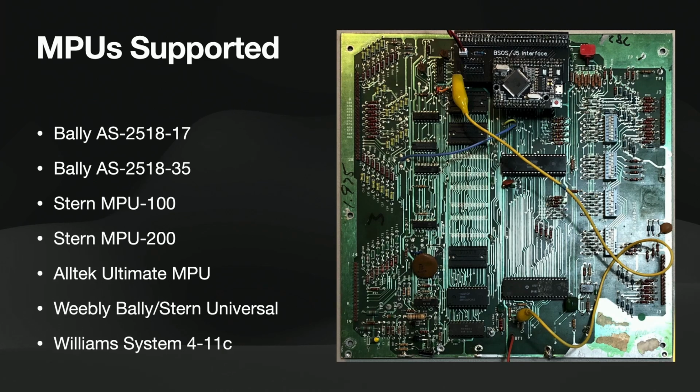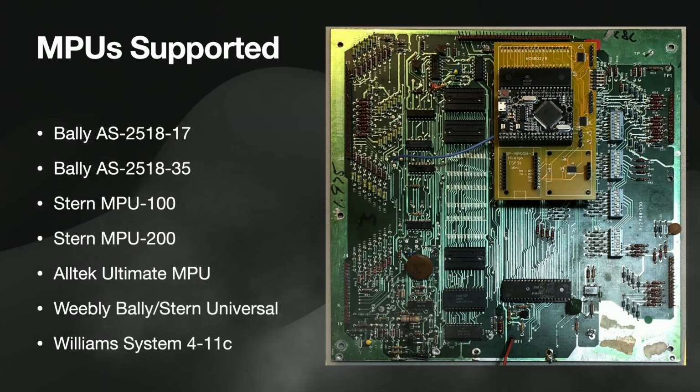So here's this board, Rev 3, plugged into that diagnostics port. It's a little hard to see in this picture, but I mirror the port pins off there. So if you do have a Stern game, like a Trident is one that I have, that has an SB100 sound card that plugs into the J5, you can just plug that into my board. My board just sits in the middle and negotiates between the two. So your old sound card will still work, old code or new code.